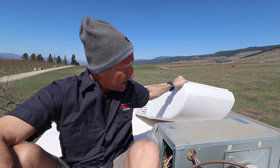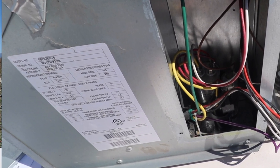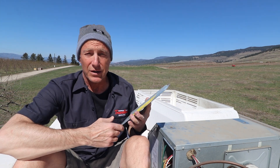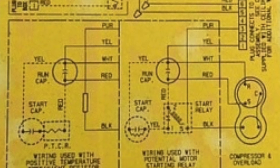Step one: you've got to get on the roof, and as you can see I've already taken off the cover. You might want to find the model number if you don't have the manual — there's a plate on the side that gives you the model number, and you can look that up to get the wiring diagram and installation instructions for Soft Start. Failing that, use the wiring diagram on the inside of the access plate to match up with Soft Start RV's installation instructions. They are fairly simple.